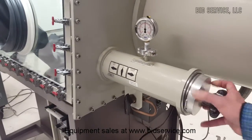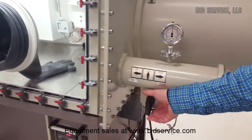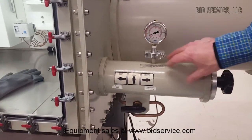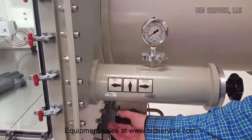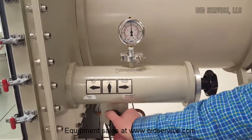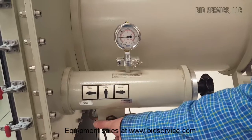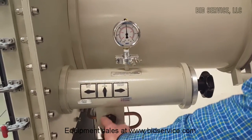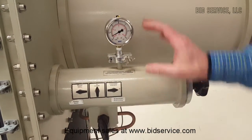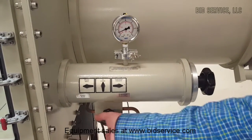Once you place your object in there and bring it inside the box, you can close it up. It's recommended that you do three cycles of evacuate and refill. So this is using the vacuum pump to evacuate, and what you'd want to do is cycle that three times — refill, evacuate, refill — just to remove any of the oxygen and water vapor out of the mini antechamber.